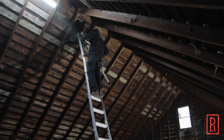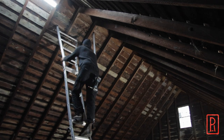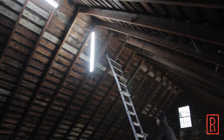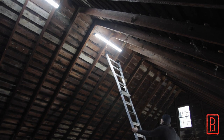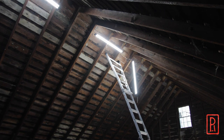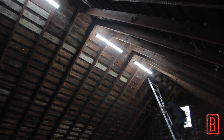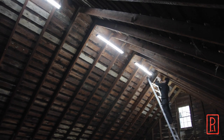Traditionally, you'd want to run all of the boxes, then all of the wiring, and then do all your connections all at once. But in this case, I wanted to run the lights and power them up first so that I could work after dark and so that the remainder of the footage I needed to film would be of higher quality. Now that the switch is wired, I can start running some of the lights. I'm using these double-bulb LED shop lights that are simple plug-in linkable lights from Amazon — I'll include a link in the description. Fairly affordable and very easy to install.